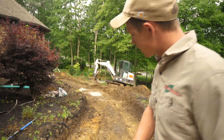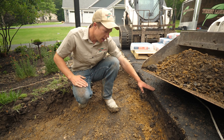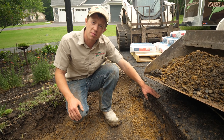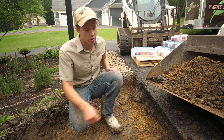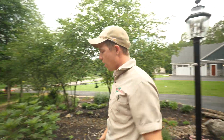I have this excavated, locked in between the driveway and the steps over there. I figured six inches of base, an inch of setting bed, and two inches of pavers — so I need to dig down nine inches total to have room for the stone, the setting bed, and the pavers and come up even. That's what we did here. We dug this all out and it's pretty solid.